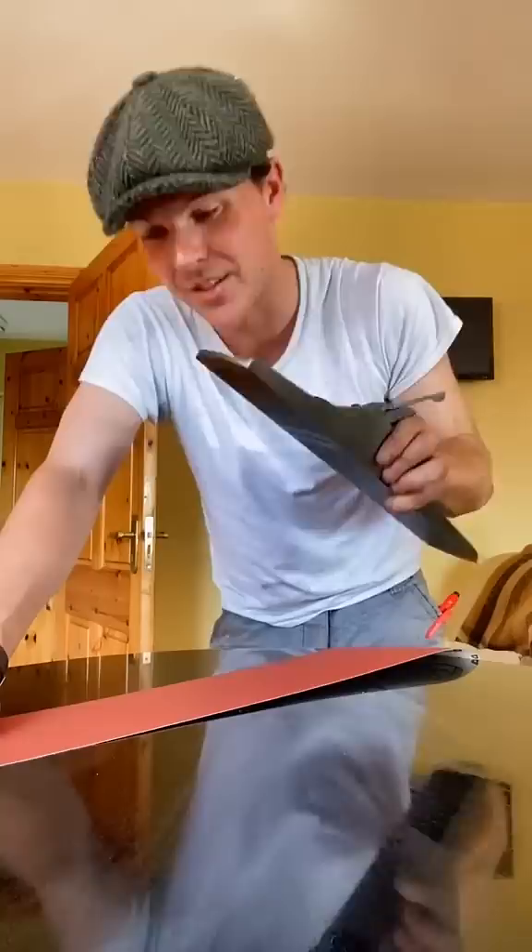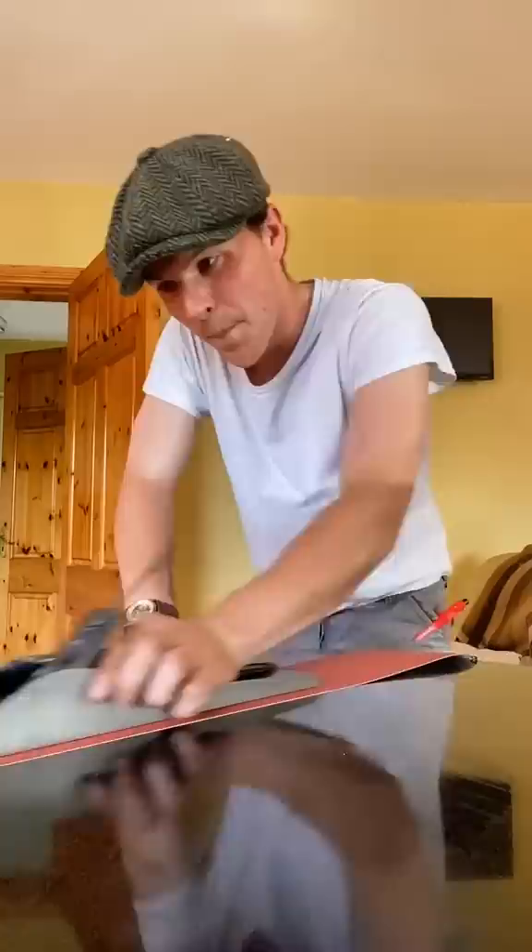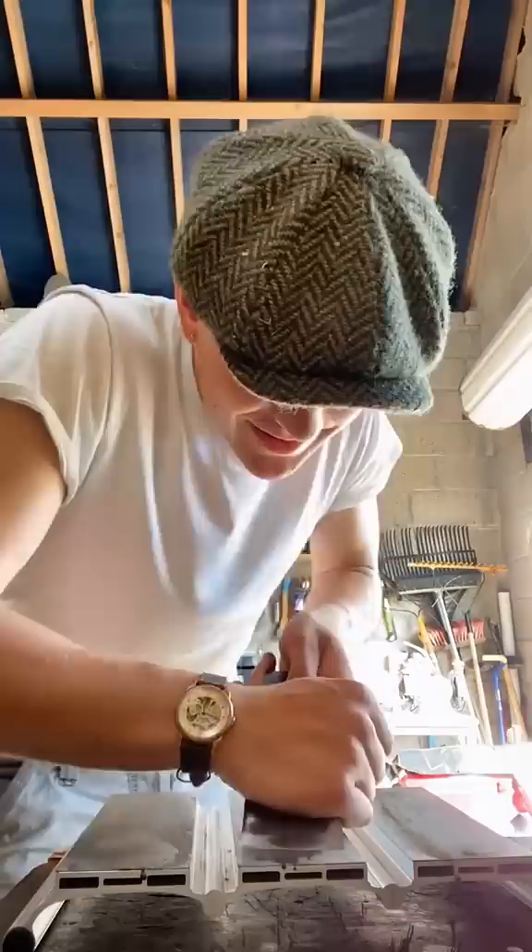So there's less friction when you're going over it. There's no way to guarantee we got a nice flat sole out of it, so I'm here on a granite countertop with some sandpaper, and we're just going to do that until we get a perfectly flat sole.